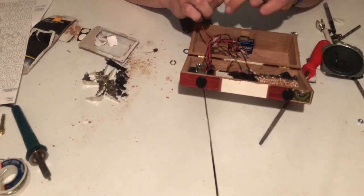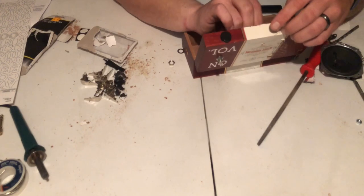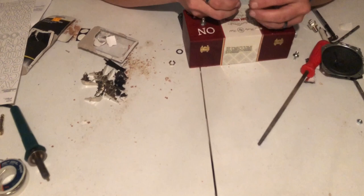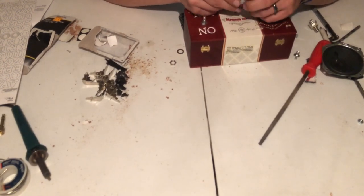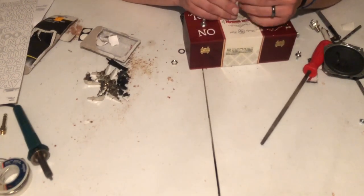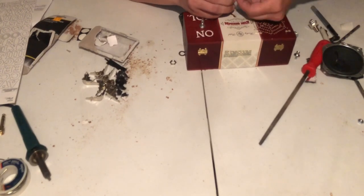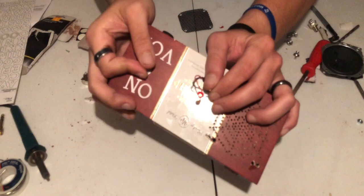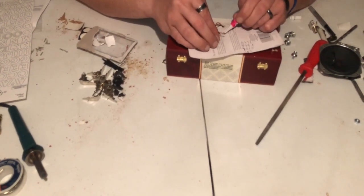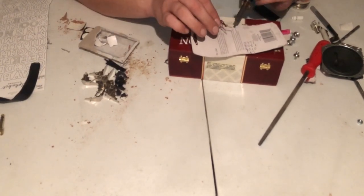What I'm doing now is taking a little bit of flame to the plastic on these wires just to expose the bare wire to prep them for soldering. I'm starting with the LED light — that's the first thing I'm going to wire up with the battery in it because that will indicate everything is working since it will flash red. You can see it there — red flashing on and off. I twisted the hot and ground wire on the LED and dabbed it with just a little bit of glue to hold in place and prepared it for soldering.